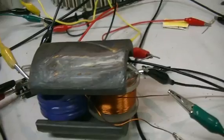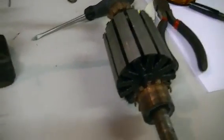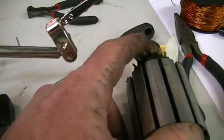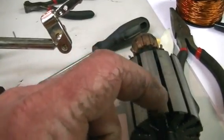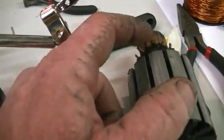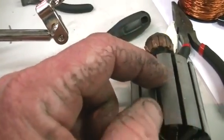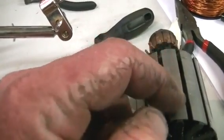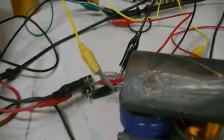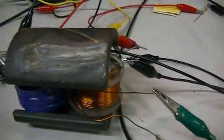Alright guys, thanks for watching. I'm going to get this video uploaded first so you can have a look, and then we'll start the build on that. We're going to have to be really careful how we wind this, because we're going to be skipping every second commutator segment - each coil takes up five blocks and we're going to miss one coil because we're missing one commutator segment. Our secondary is actually going to start from that block that was missed by the primary. Pretty large success indeed - thanks for watching.